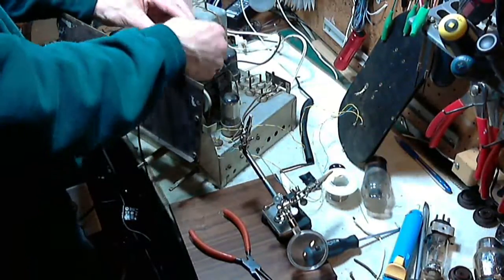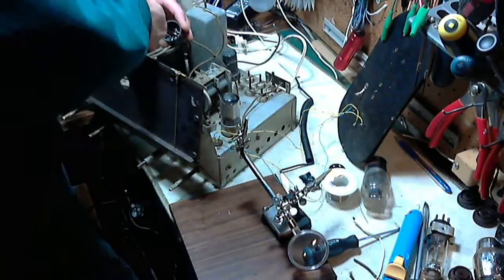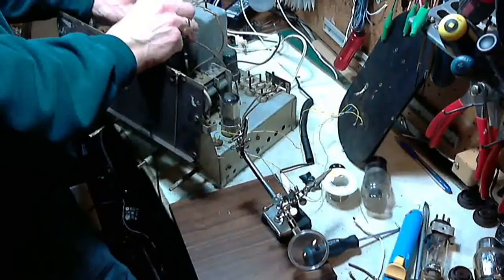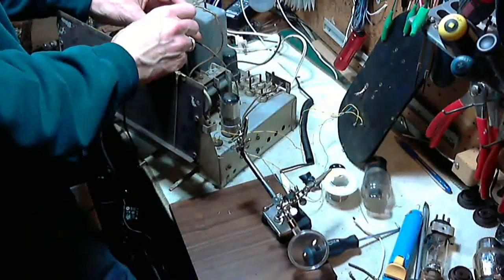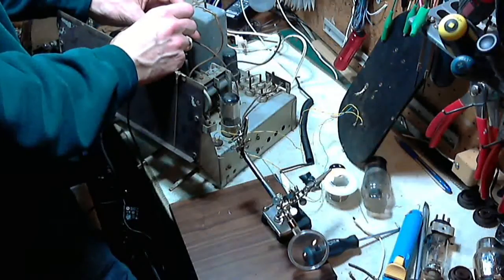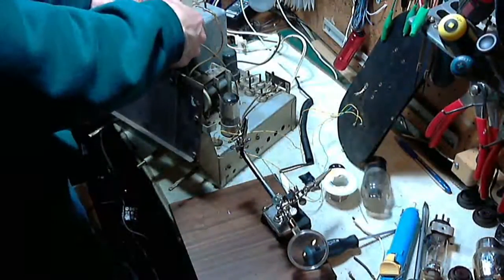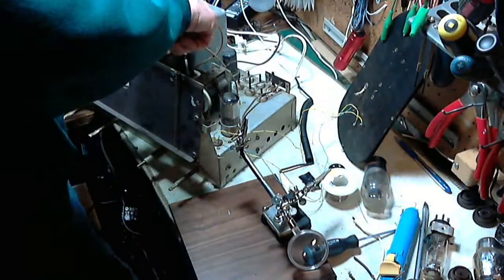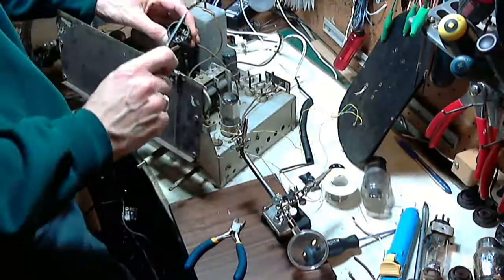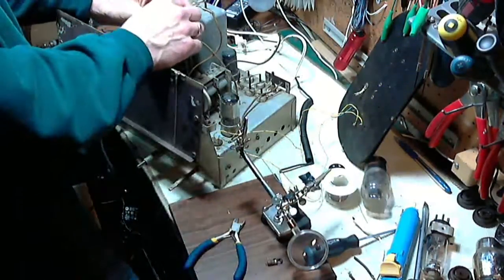Just a little fatter. The resistor in there, right in the middle, is taking up a fair bit of space. Maybe I can squeeze it over here. Replace that resistor. The one I put in will be slightly smaller. Oh, wow. Could pull the resistor right out of there now. I think I'm going to do that. It's going to make things a lot easier. I'll leave the tails on. That's a brown, black, green, 1 megohm. Just what I expected.